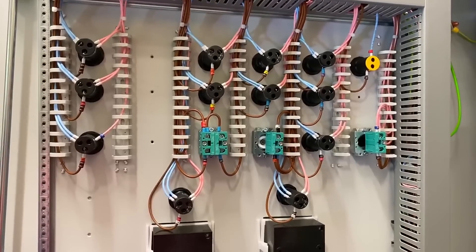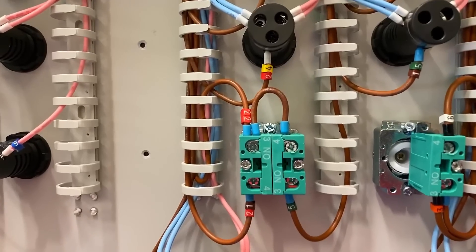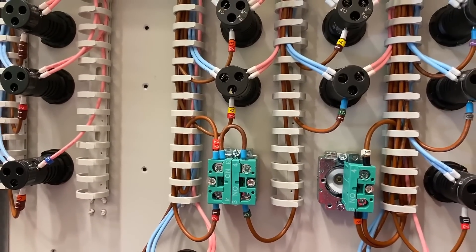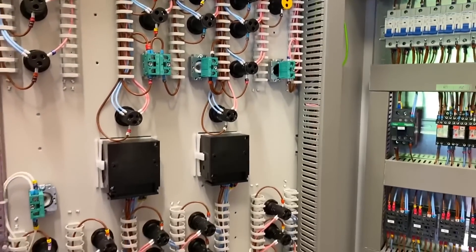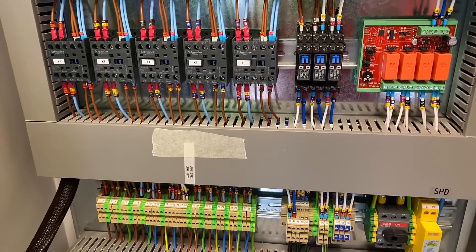Do you keep a set yourself? Yeah, there's always a set yourself. So if I came to site and there was an issue, I could look at this schematic drawing, hopefully work out maybe number 24 and where it goes, and maybe that indicator lamp or switch has failed — I can trace it through using a logical approach. For many of us, fault finding in here looks a little bit of a headache, but the better you've laid it out and the better the numbering system, obviously the easier it will be to sort out a fault.